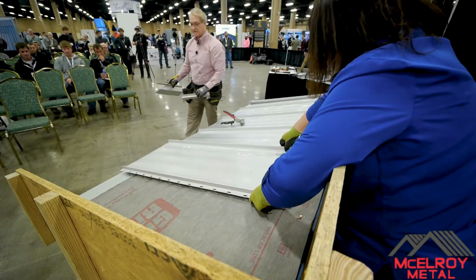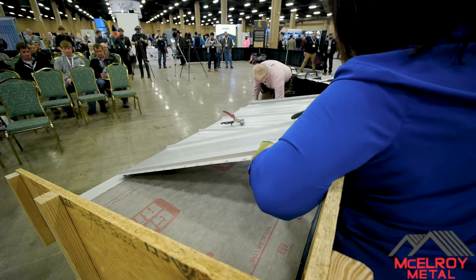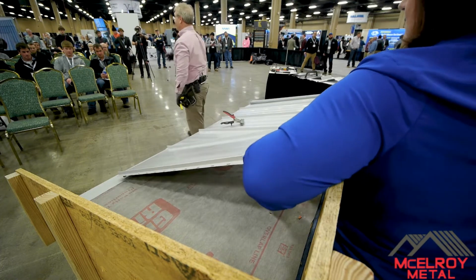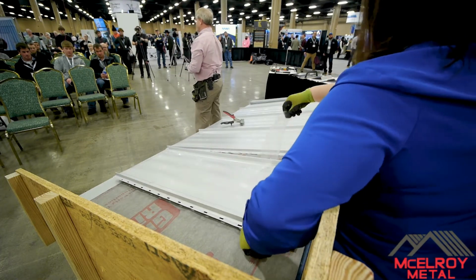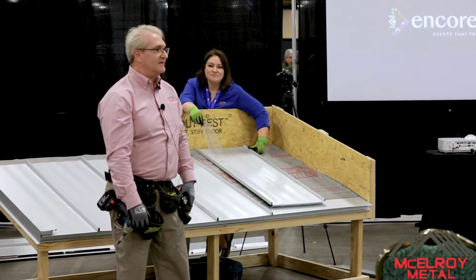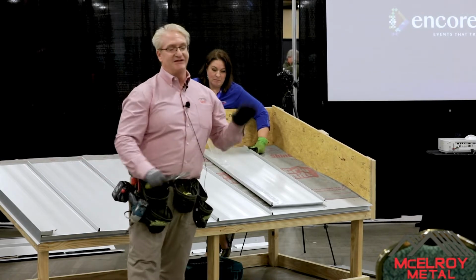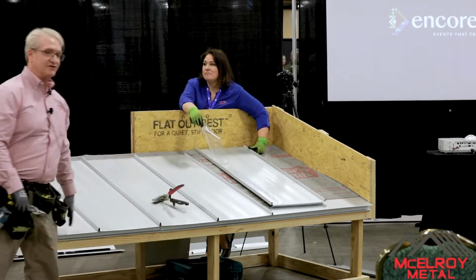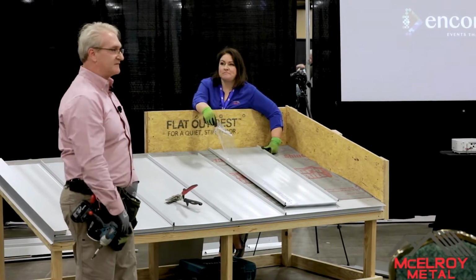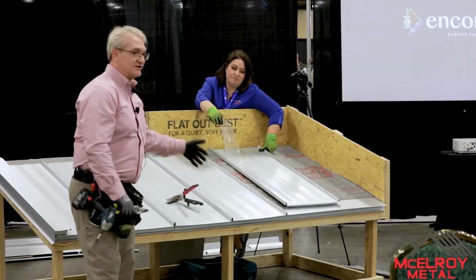Yeah, and notice, I'm sorry, the one thing I forgot to mention is there's film on the panels. So please make sure you peel off the film. It's very important. You'd be surprised at how many times we get called out to a paint claim where something looks like it's chipping or cracking, and the person forgot to take off the strippable film, okay? Especially on drip edge, or especially on all your trims. They'll have film from us because we have to fold it and make it into the right part and put the right pitch on it for you, okay? So please make sure you do that.